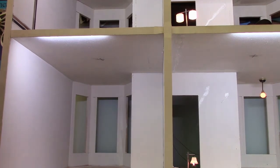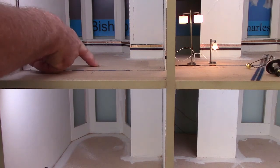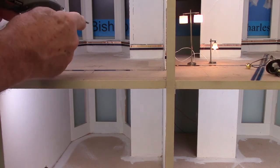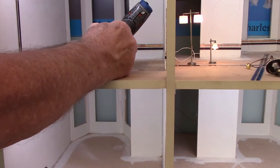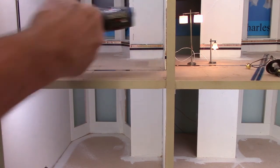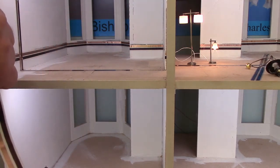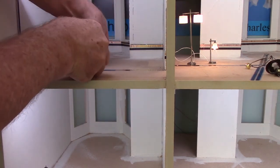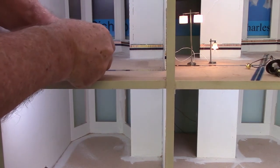And before we put the spring-loaded eyelets into those holes, we're going to go up to the floor up above, and where the two holes came through here, I like to take my Dremel with a grinding bit on it, and I can grind a little bit of a valley across those two holes that we put in here. Then I'll come back with my tape and we'll run it straight this way.